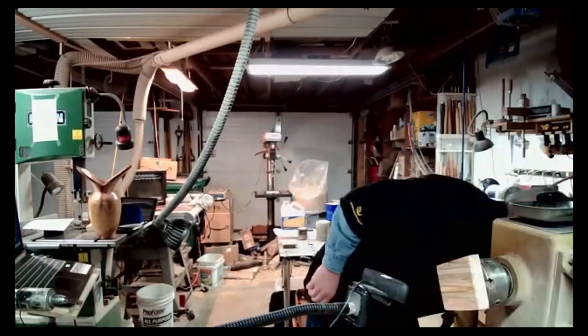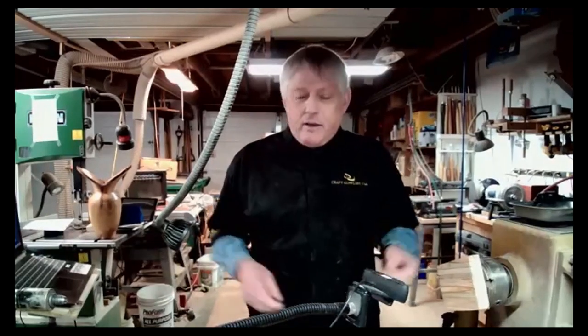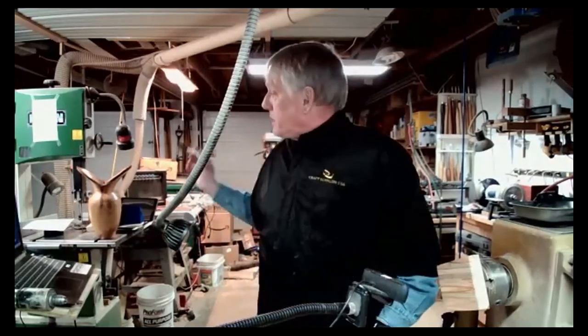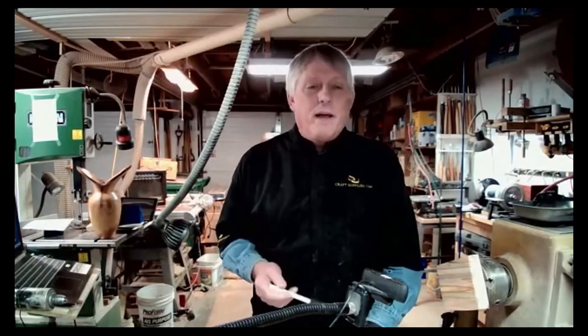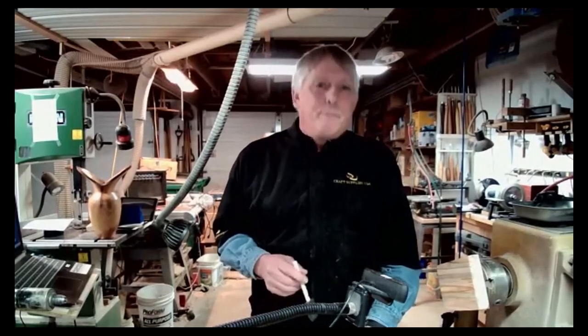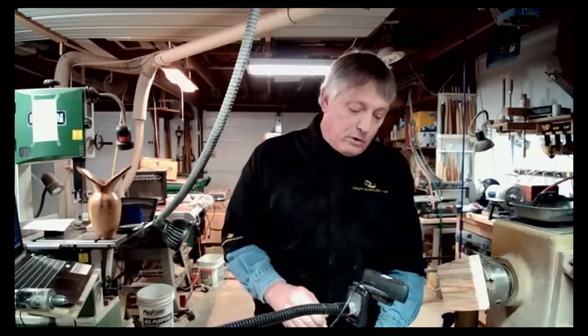So I guess I'm debunking some of the things I've seen, where they say make sure you do this and don't buy this. I've done it with just stuff I've had at hand, and it's worked just fine. I have some nice pieces that have won me awards to prove that you don't have to get pure tung oil, and you don't have to get waxless shellac. You can use what you get from your local store.